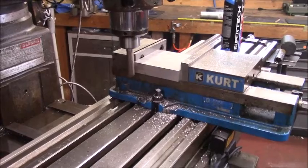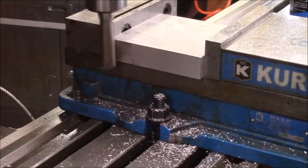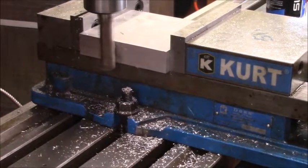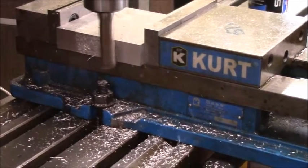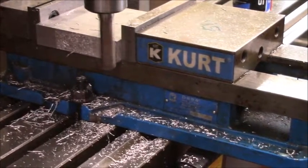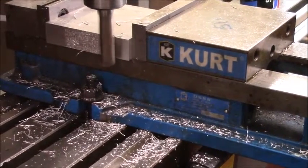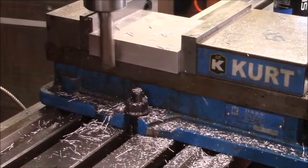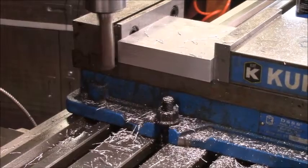We're going to take a nice mill cut right here and start to square this thing up. I'm just going to square it up — not trying to get real fancy. This doesn't have to be precise, just somewhat square. To get it somewhat square, I want it to be a certain size, but that's coming a little later. So all I'm doing right now is cleaning up. I'm going to take a light pass at the mill here, just run down and hand-feed across to make it nice and pretty looking. That's one side.